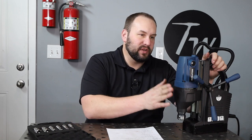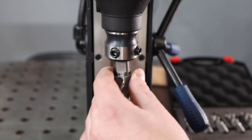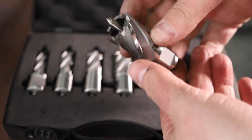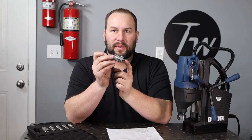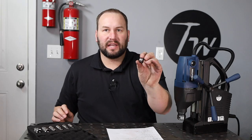400 RPM is a low speed for most twist drill bits, which is going to be just fine — it'll just move a little bit slower than you could at a higher speed. That's because this is really optimized for use with those annular cutters. Even drilling through this steel plate with a smaller diameter — this is a quarter inch or six millimeter diameter bit — it goes through really well and quickly, and I know I'm going to have a nice straight hole. Now let's switch over to use some annular cutters. I'm going to install them the same way as the drill bit. Each of these cutters has a little pin inside in the center — that serves two purposes: it allows you to line up the center of your hole with a mark or a scribe line, and there's a spring up inside the drill that will press down to pop the slug out after you drill.